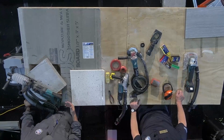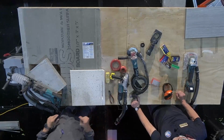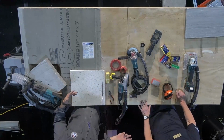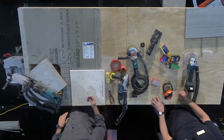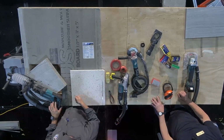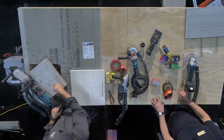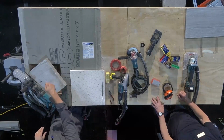Mark, years ago I had to work on a job where we had to drill hundreds of these holes. Sure. And we drilled all the holes and we got the dust flying everywhere, right? We didn't know any better. Right. Didn't have the benefit of this week and this class that we have today. But then what the boss man gave us was an air compressor and an air hose. But you got to blow out those holes after they're drilled too. So we get another big cloud of that silica dust right in our face to clean out the hole.